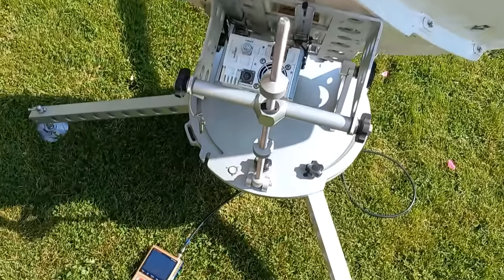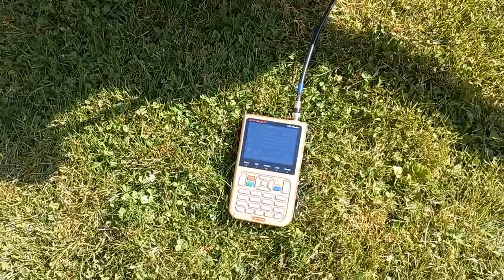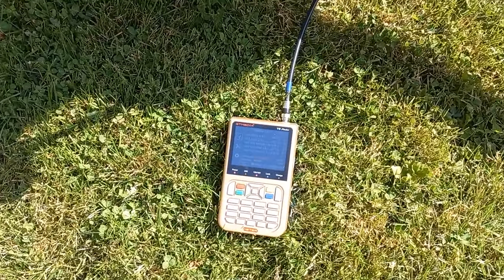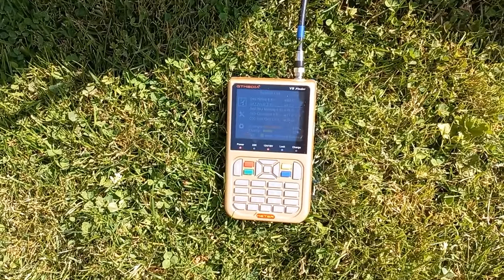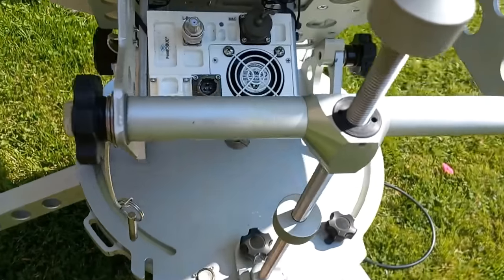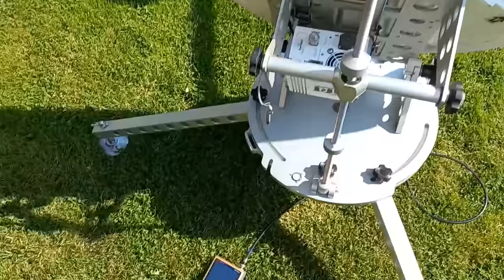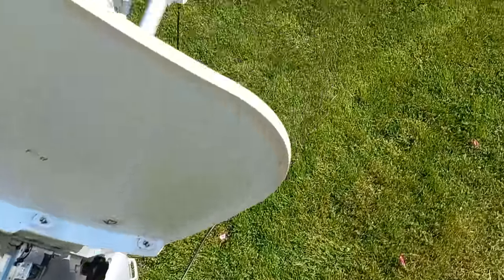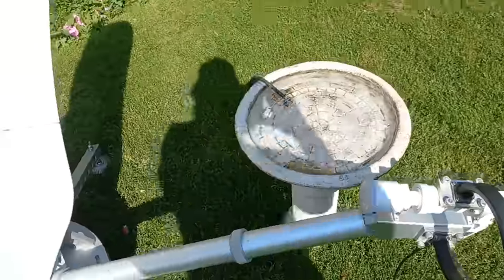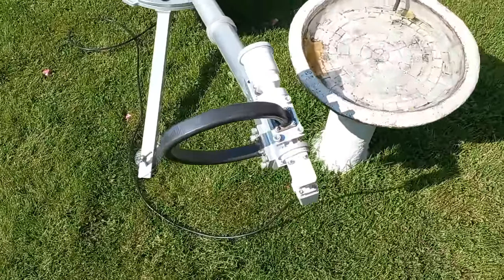And then, oh, you hear that? You see? I'm getting close. And, yeah, see it turns green, the little line there. I'm gonna hit the right signal. And then what I'm gonna do is clamp that down, and it'll be locked on that satellite. And then I'm gonna bring out a spectrum analyzer and we can peak it to make sure it's bang on the satellite. And yeah, we're also gonna play with the skew.